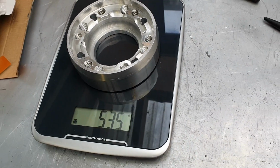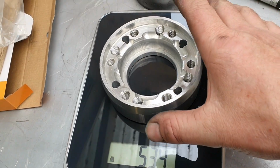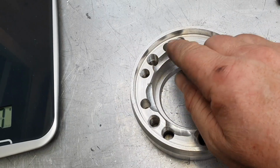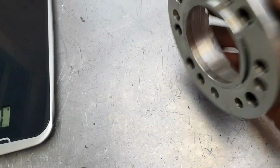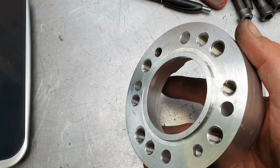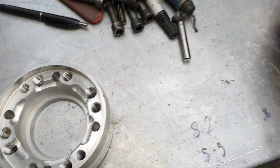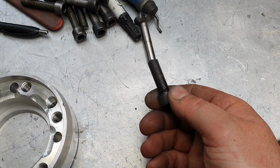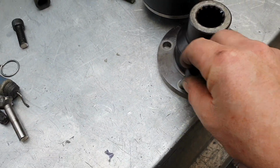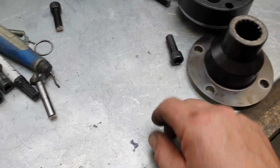Pretty light, eh? It actually just... Oh, look, it's going backwards and forwards. Losing weight, gaining weight. That's actually helicoils. I have put helicoils in it just to give it more guts, more strong. There's only 2 that I haven't done at the moment, which I probably will do. And I want to get some longer ones for the 7/16 UNF bolts, which are the correct size for our flange here. I was going to drill this out to 12mm, but decided against it.